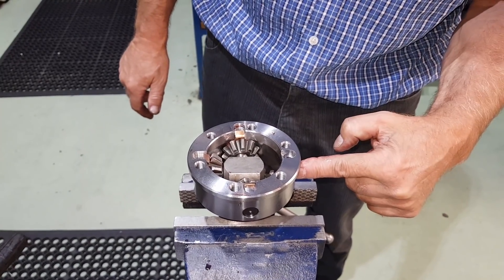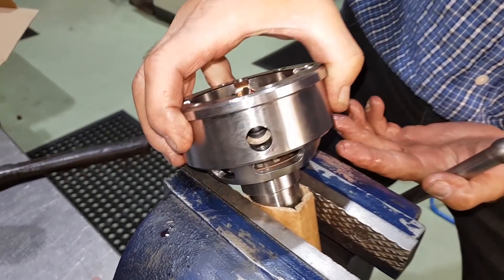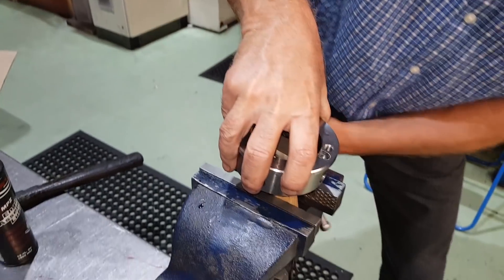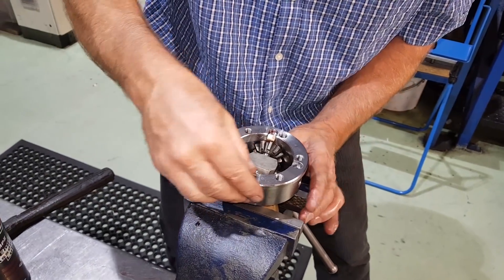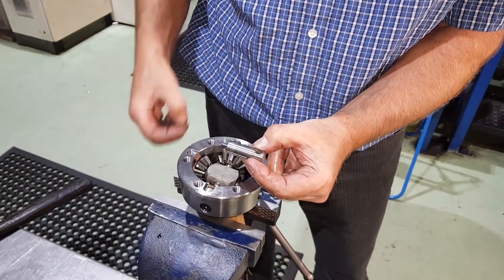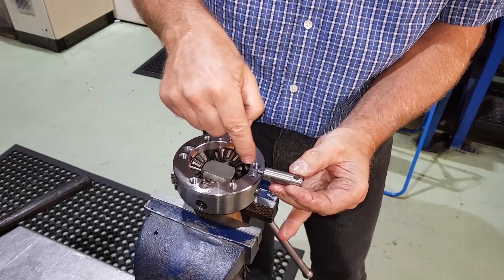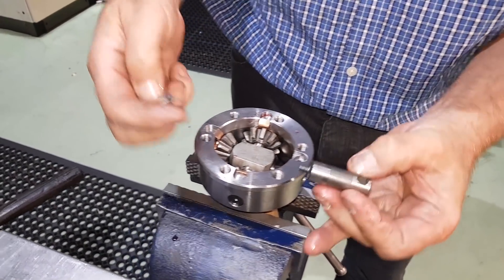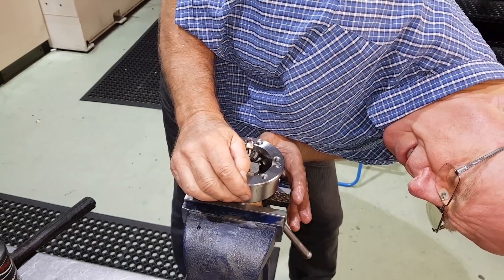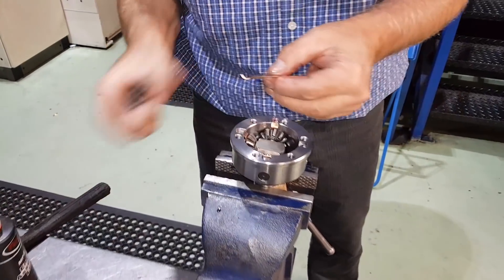You must make sure now that the hole in that shaft is in line with the pin that's going to go in here. Check that the hole is central. After this is in place, the location for this is the screw — this screw goes down through that hole and screws into the bottom of the casing, so you've got to have that hole in line with this screw. Jiggle the shaft a little bit further around because it's not quite in line — this is where you need a few more hands.